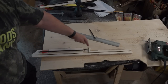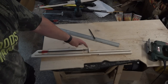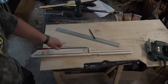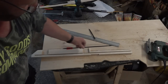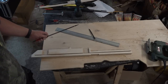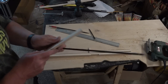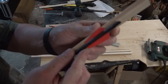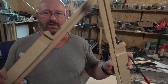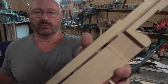We've sawed out these parts which are like the second layer, and as you see it's almost the same but it has cutouts for the broadheads and also for the vanes, plus the slot is continued because that's where the vanes will go through later on. You also need to saw this out twice. Then there's going to be an inner layer that connects the two halves, and this ideally you saw out from a material that is thick enough so that the vanes will actually fit.